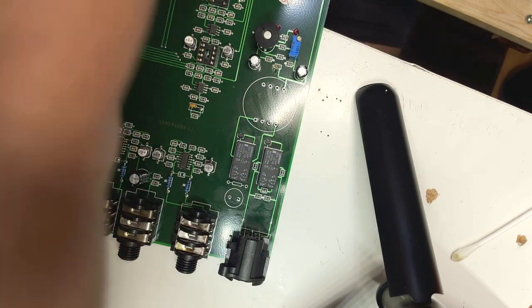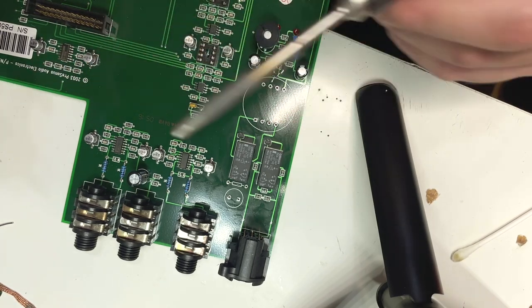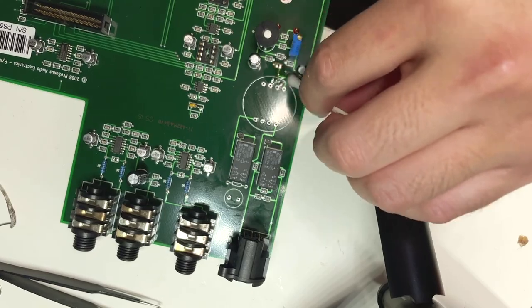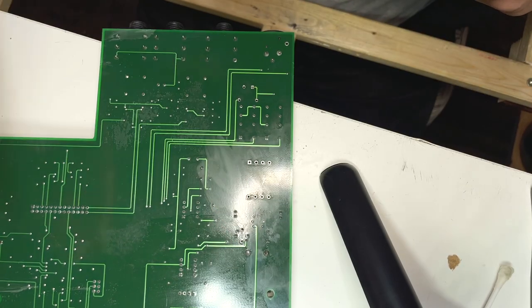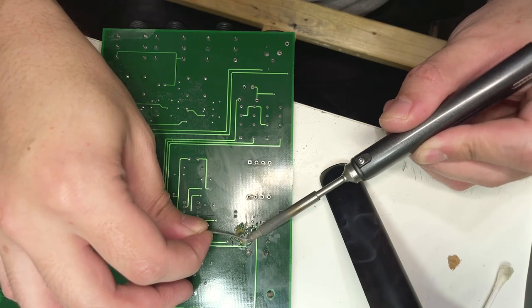The load resistor needs to be changed out to match the impedance of the new Cinemag transformer, so I remove the old 49K resistor and install a new 18K resistor in its place. The U441 dual N-channel JFET is held on by 6 pins. I remove it using Quick Chip.